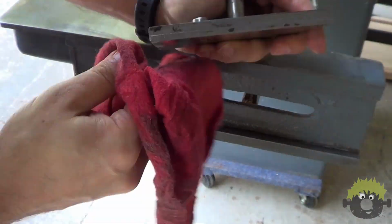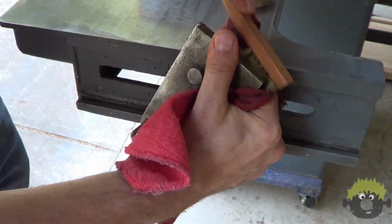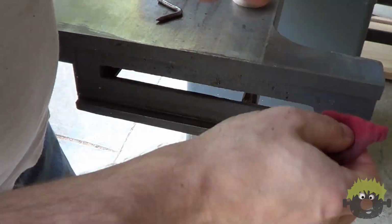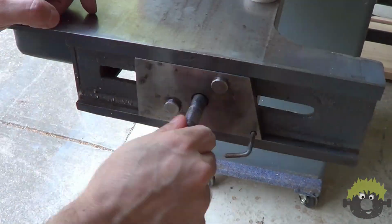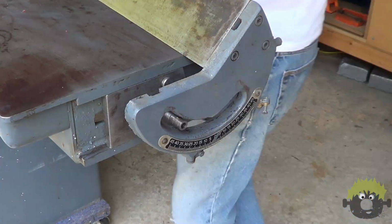The knife gibs had apparently gotten jammed in the cutter head at some point, and the former owner had sheared off several of the gib screws while trying to remove them. Additionally, the top had several places of heavy rusting that would need to be cleaned and polished out. The electrics were sketchy, and it looked like it was missing a few pieces of hardware.